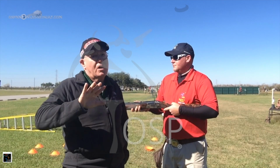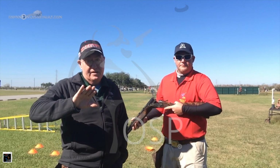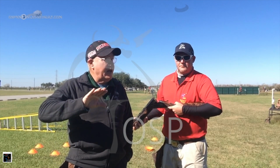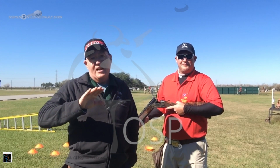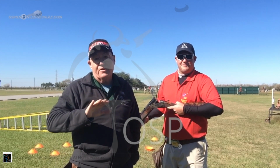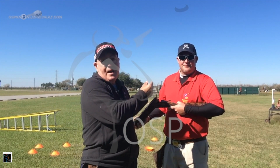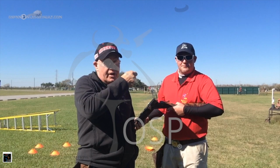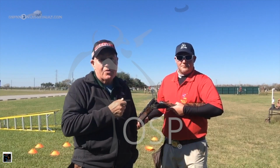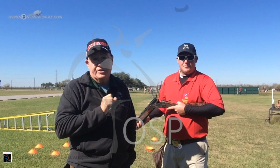So I want to talk a little bit now about the 4-to-1 ratio, okay? Don't ask me how it works. Don't ask me why it works. This is about a $35,000 lesson that I learned 23 years ago when I started fitting stocks. If you lengthen the stock by 1/4 of an inch, you'll open the gap between the nose and the thumb knuckle by 1 inch. It's a 4-to-1 ratio.